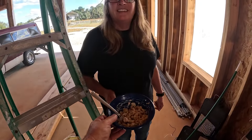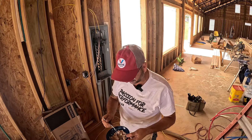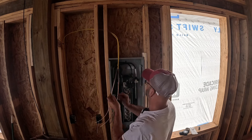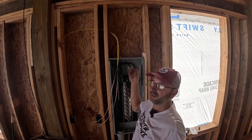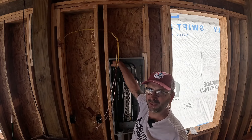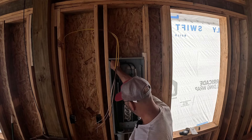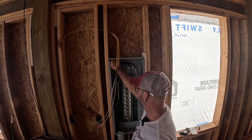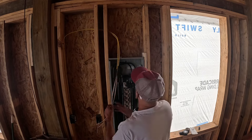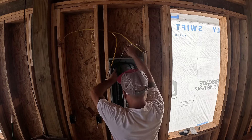Someone brought me some macaroni salad with tuna in it - world's best! In case you're wondering what we used for conductors here: we've got 2-aught copper. If this was aluminum you could use 4-aught, because for residential there's an exception to the code where you can basically step it down a size. If this was a commercial project, you'd need 3-aught copper and 250 MCM aluminum for 200 amp. I spent the fortune and did copper because it's my house and I don't ever plan on leaving. We've got our couple of circuits - I'll get these tied in. Be careful because this panel is hot. I could shut it off outside but these are all shielded really well.